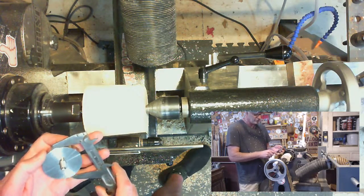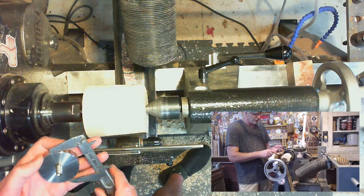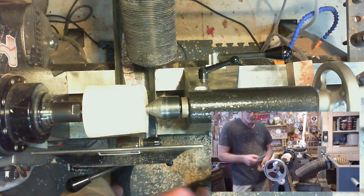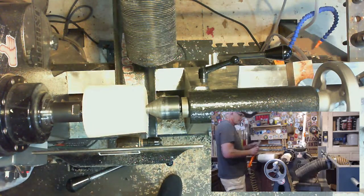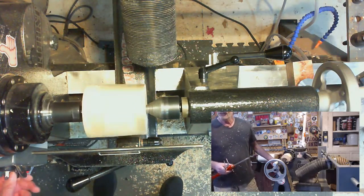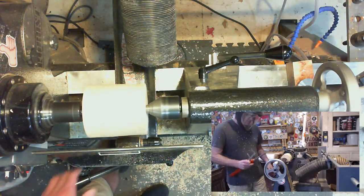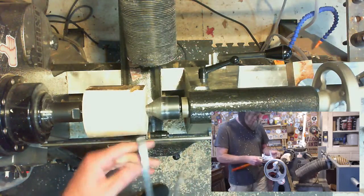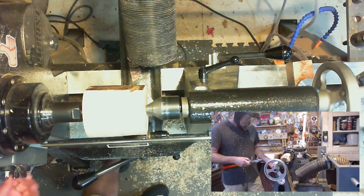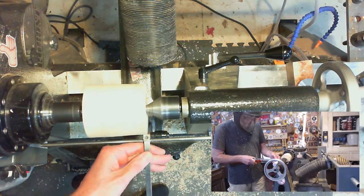All right, so we're going to bring it down to a little bit bigger than that diameter, just barely, and then we'll refine it. All good, the camera's good, I moved it back. And this is the easy wood rougher, the square one. And I'm going to bump the lathe up a little bit, about 2,500.